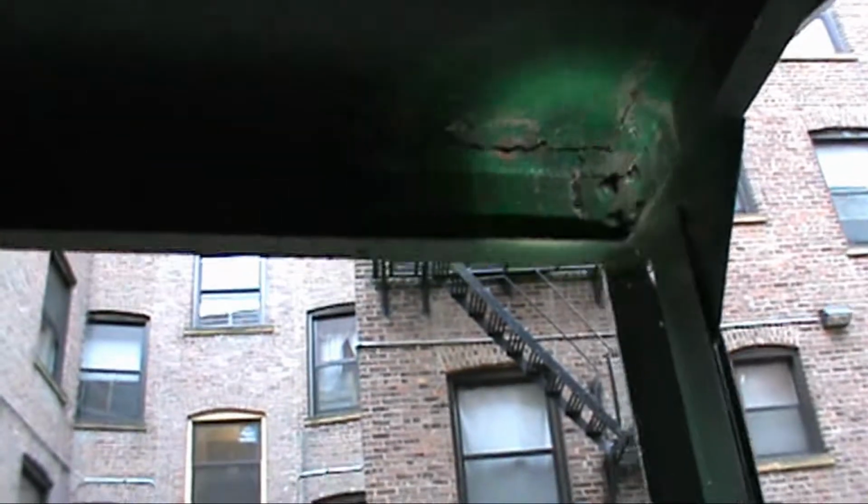But here's a perfect example of this situation here, where there was a band they put here. See right here. So there's no reinforcement underneath here. There's a diamond plate up above. They didn't clean out all this rotten steel and then seal it from future corrosion. And here's another corner. And that channel, look how thin that channel is. So all these corners need to be rebuilt.